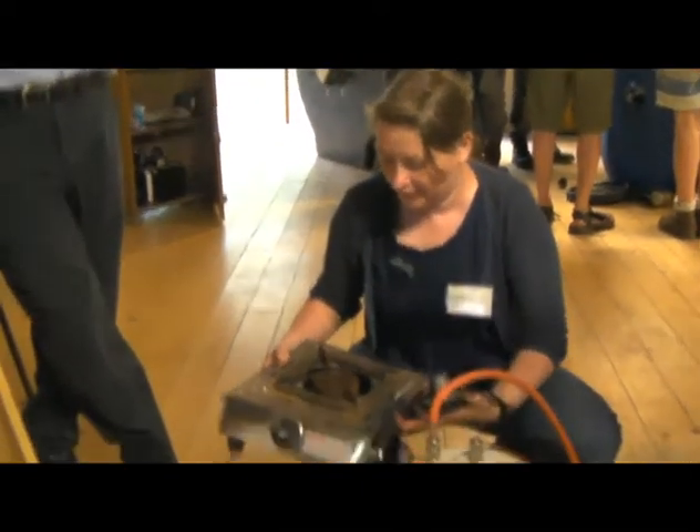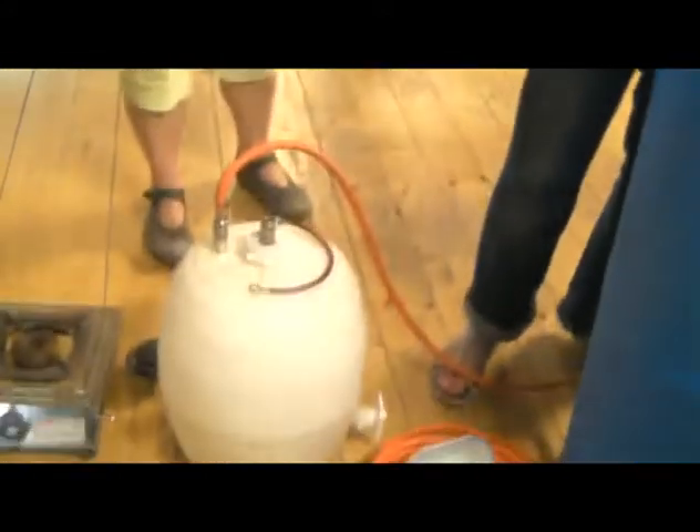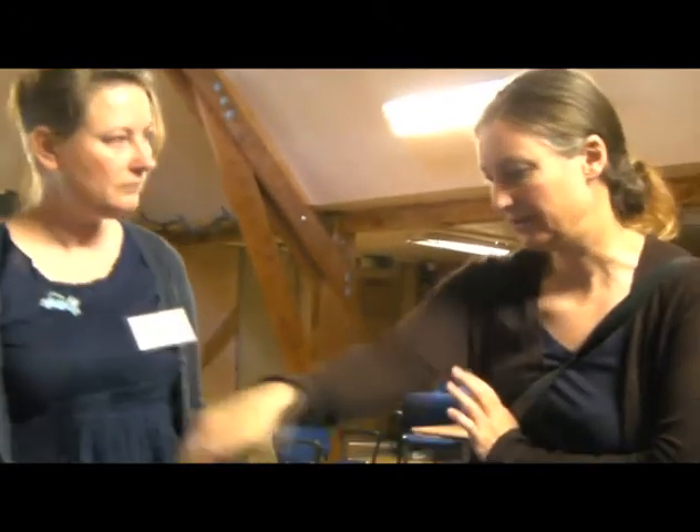So where do you store your gas? The gas is actually stored in the barrel. As it comes in, it just fills it up. So it just kind of fills out, yeah. That's kind of a further constant thing — this is where it all gathers. Ideally you would have the scrubber between your digester and the gas storage. It acts as a condensation trap. As it lifts up you'll get some pressure building. Rather than it pulling down, if you want a bit more pressure you can just press it down. That needs a bit of calibration — it's kind of trial and error.